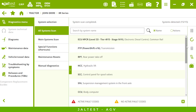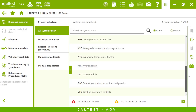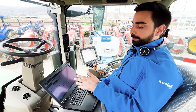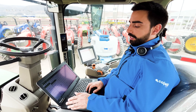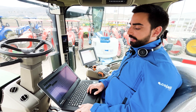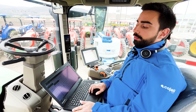As you can see, we have finished the scan of the systems. We have 17 different systems here: the engine, the transmission, the PTO, all the hydraulic systems, the spool valves, the body computer, the instrument cluster. Remember that we also have the auto guidance systems, the GPS, the steering controller, the roof lights, the cabin module, and all the other systems that this tractor may have when you connect to it.